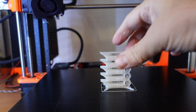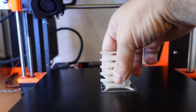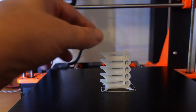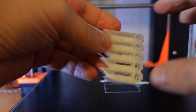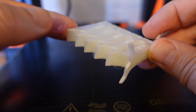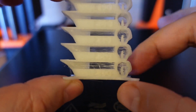Printing is finished. Bed adhesion check — it is good, like regular PLA. Now we wait until the bed cools down. After the print surface cooled, I can see that partly thanks to the glass fibers there are great overhang and bridging properties. But the only problem is that stringing.